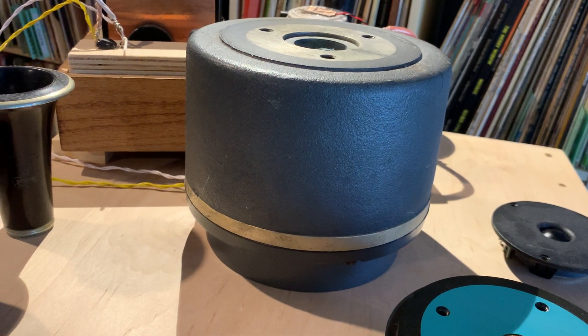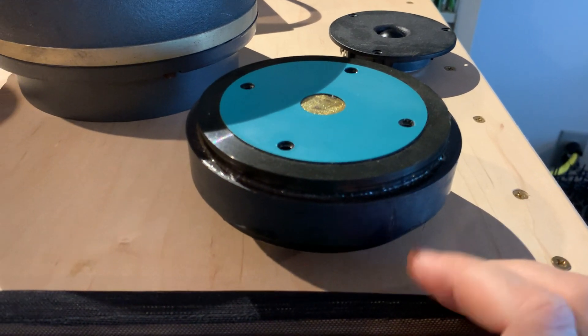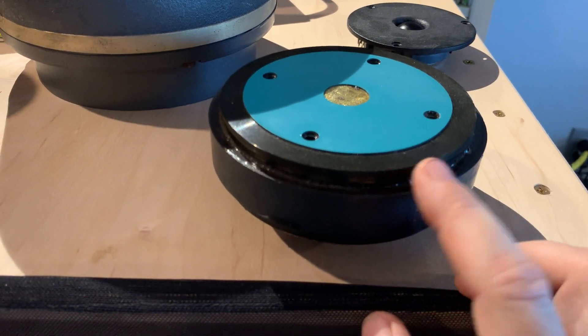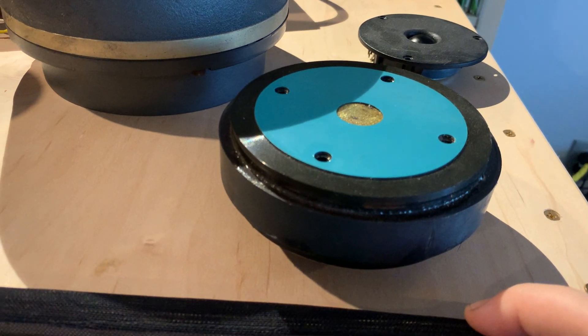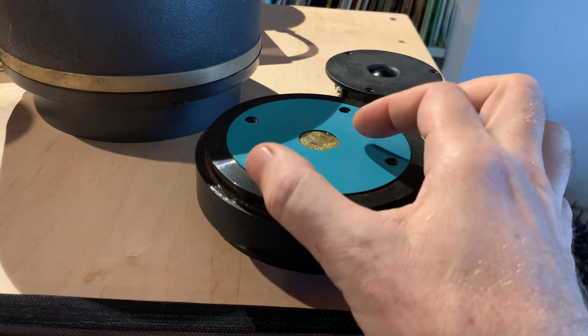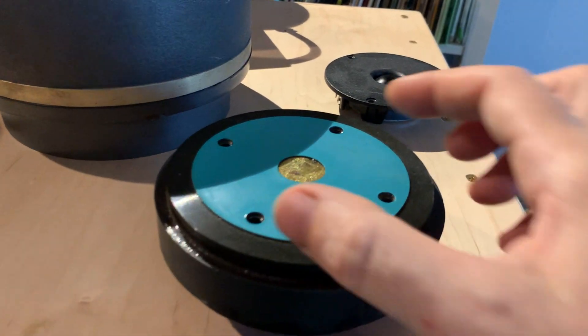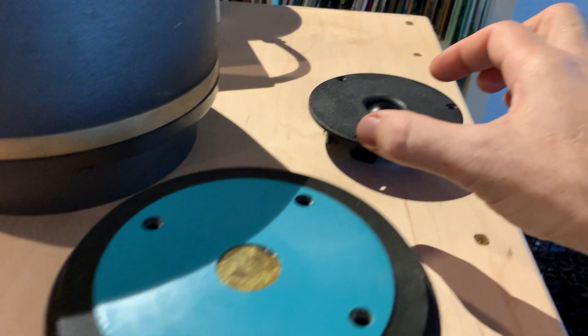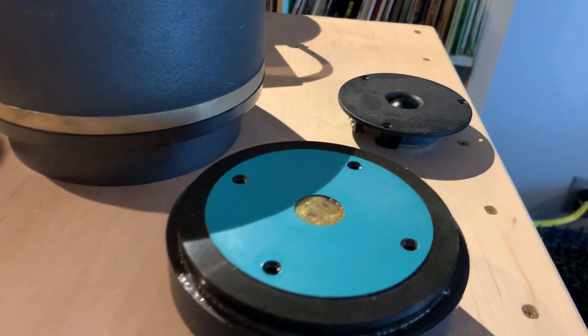For a home setting it is possible to use these drivers down to very low frequencies, although at 200 Hz you would need a tremendously big horn that won't fit in a living room. So in a home setting — with or without a horn — 500 Hz is the lowest realistic limit for the big driver. For this baby here, the self-resonant frequency will be much higher than 260 Hz, as it has a two-inch diaphragm — yet that two-inch diaphragm is still large compared to the tiny dome on a tweeter.